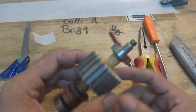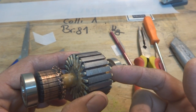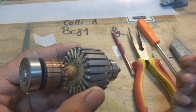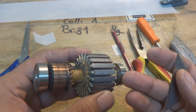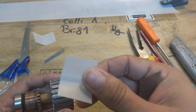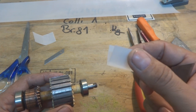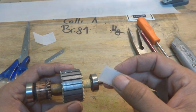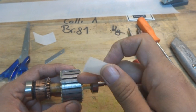That would be a very dangerous situation — a short circuit or grounding. To avoid this, we need to put insulation inside the slots. While removing the old wire from the armature, there is insulation lining inside these slots, which we also remove because it breaks down with the old winding. Then we apply new lining. This insulating paper in my hand — it could be Mylar or similar — insulates the winding from the metal laminations, which is called the core.